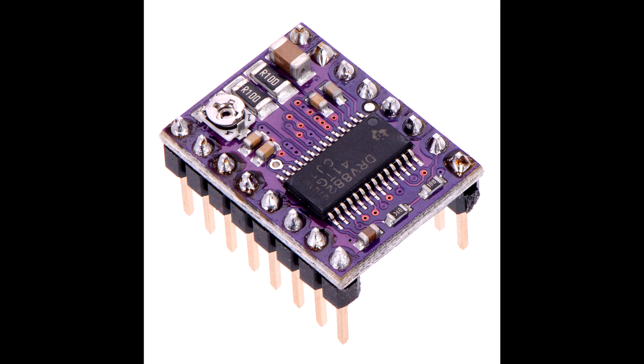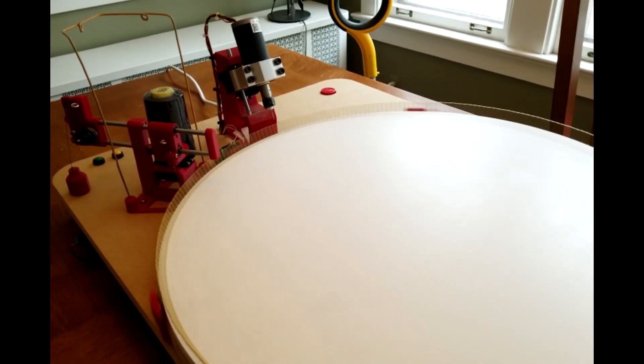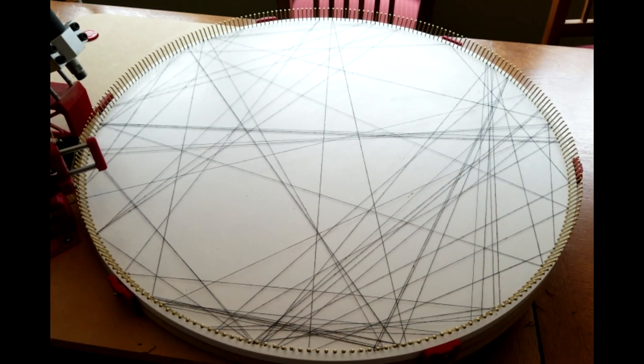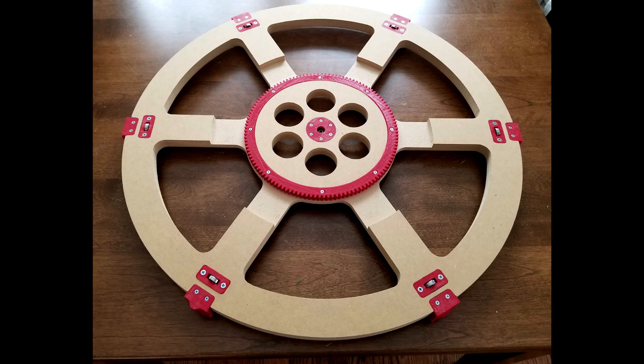Initially I was using a TI DRV8825 stepper motor module. The acceleration and top speed were surprisingly good, but I was getting an oscillation with quick stops — it would stop at the correct point but oscillate for a fraction of a second. I think the motor just needed more current to hold the stop. I switched to a big DSP-based driver, and the acceleration was about four times faster. Top speed can be very fast, but the machine will never do more than a half rotation to get to the next pin, so acceleration is actually the limiting factor. It never goes more than a half rotation because that would cause slack in the thread. The G-code generator always chooses the shortest path to the next pin. The platter has a central bearing and rides on six perimeter bearings that act like wheels.